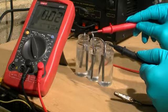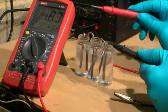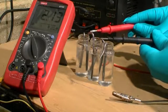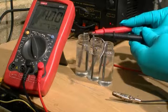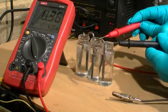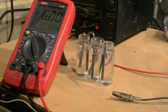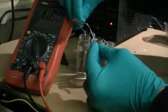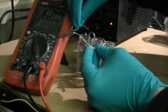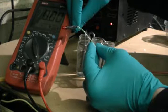We can now apply a voltmeter and we can see the voltage across the battery. In a lead acid battery, each cell gives just over 2 volts, so therefore within the 3 cells we're getting about 6 volts, which is what we're reading on our voltmeter. After dimming the lights, we've connected an LED to our battery, and we can successfully see that our battery is powering our LED.